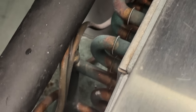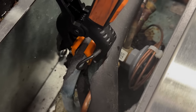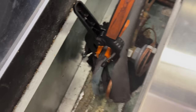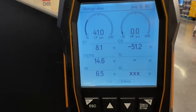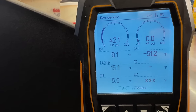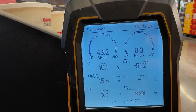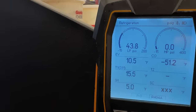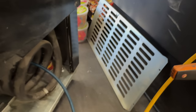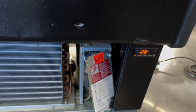It would come right in here where it's coming right out of the coil, before it connects with the other ones — see what kind of superheat we've got. We're down to 34 degrees pretty quick. We are clamped on the suction. You can see our superheat now — this finally came down. We are running about a 10 degree evaporator. It came down to 29 degrees and shut off — so it's happy. Fan's running.